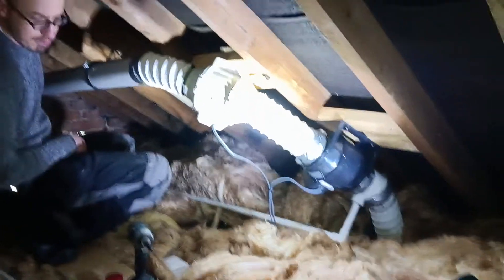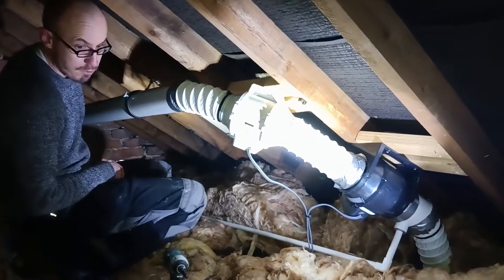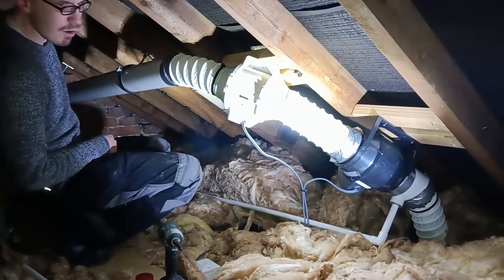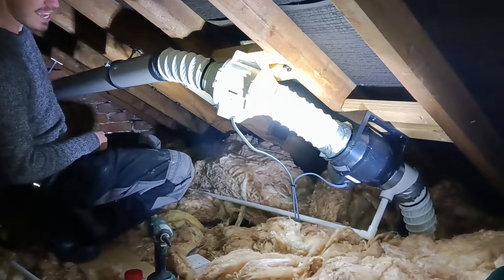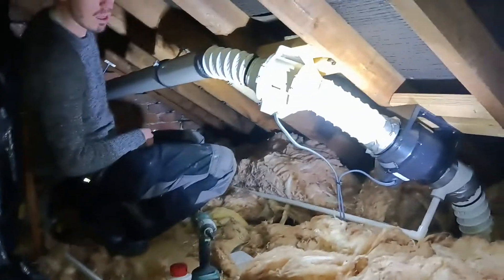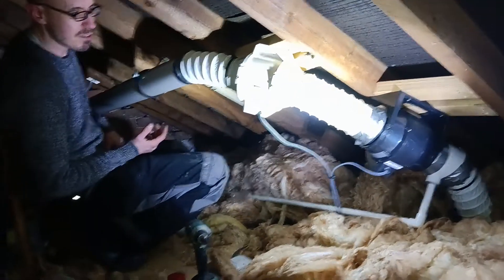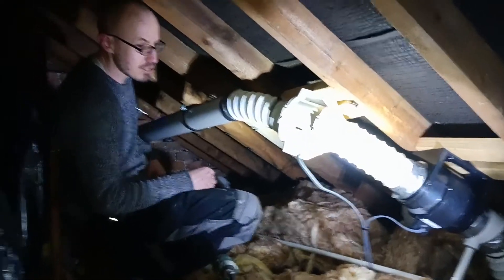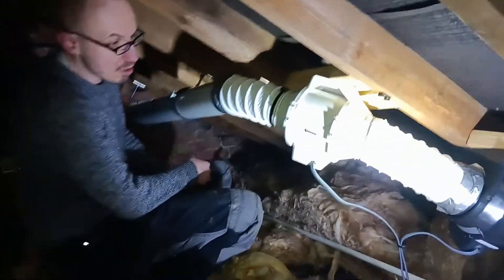Because they were suffering with water falling back down through the vent, and because we had to gain quite a lot of height, the vent height over here — I would have liked it to be a bit lower, but we had to work with what we had. We've stuck a condensation trap with a condensate pipe that goes outside for them.